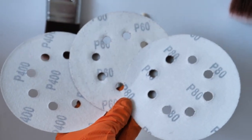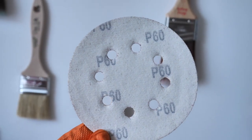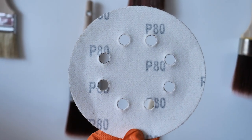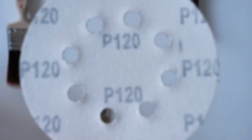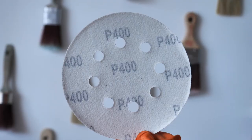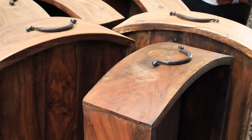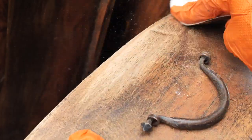For this piece we use the 60, 80, and 400 grit. We have a range of sanding pads starting with 60 which is the lowest, so it is the most abrasive, and as the numbers go up the sanding pads get finer and finer. Our finest one is 400. The middle ones you need to pick depending on what kind of project you are working on.